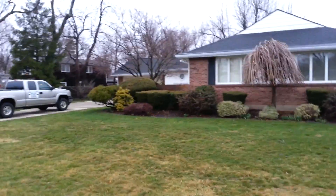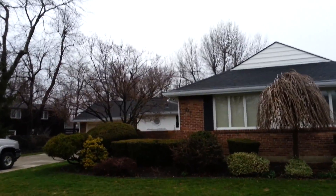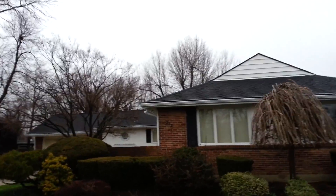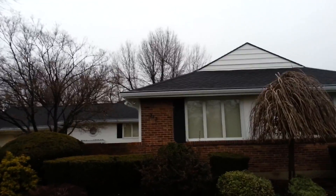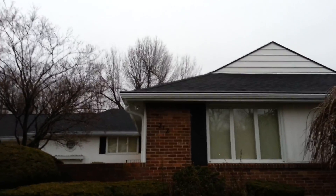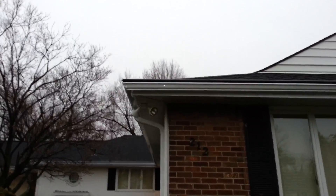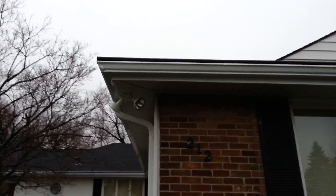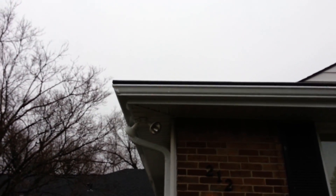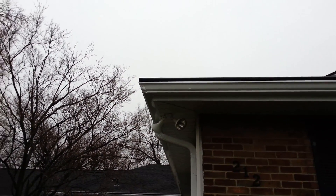Here's a house that we did with the roof edge that had to be completely reworked. We ended up getting rid of the multi-galvanized roof edge that was underneath the roofing that somebody had left on, which caused a whole lot of rust stains behind the old gutter and underneath the fascias. We took off a competitor's product, which was failing anyways — which most of them do.